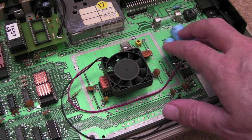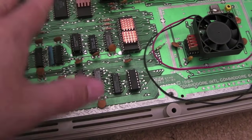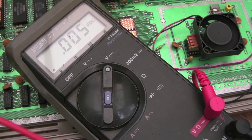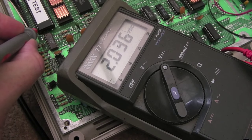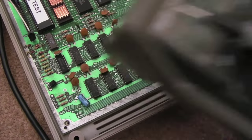After that — nice, clean, stable power supply. Rainbow Islands runs forever. I played it and played it and got up to about level four. Now back to the scenario where the game still skips. The VCC is measuring 5.07 volts — we've got a really good 5-volt signal now. So that was sorted, but we've still got the problem.